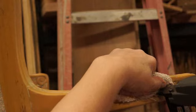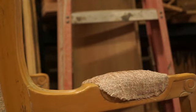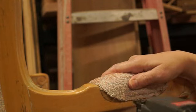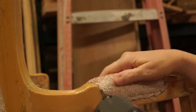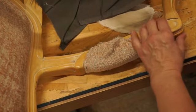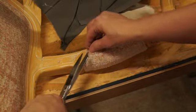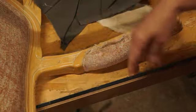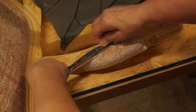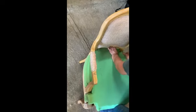Check the inside to make sure you're not short on fabric, and you do want that to have just a little bump so it's comfortable on the arm. They folded the top edge down so there's no raw edge at the top of the arm. Then I'm stapling the inside. Move the chair to a comfortable working position rather than contorting your body. I got a roller cutter from Dollar Tree — it made it much easier to trim that hanging piece away, especially with a woven fabric where you don't want to pull a thread and cause fraying.